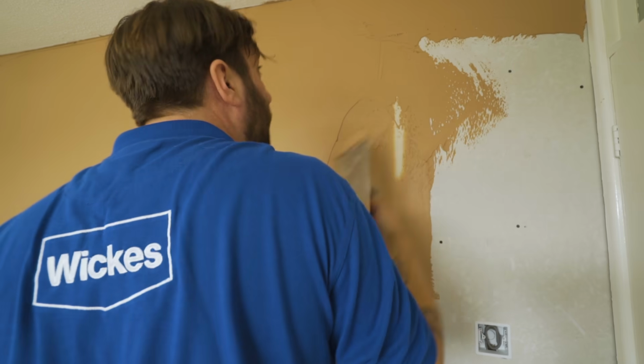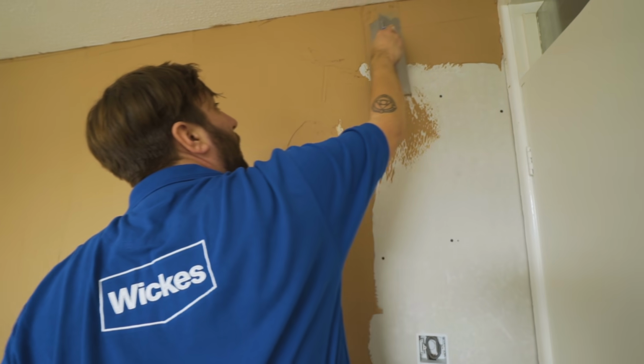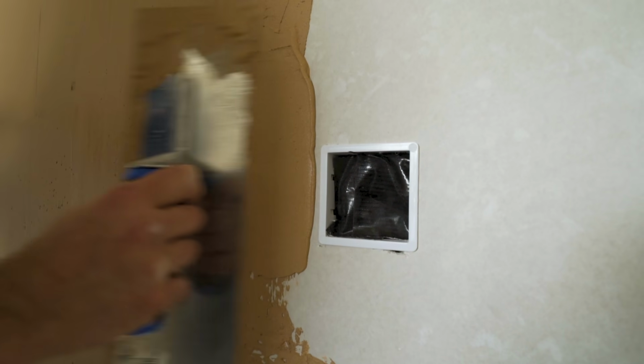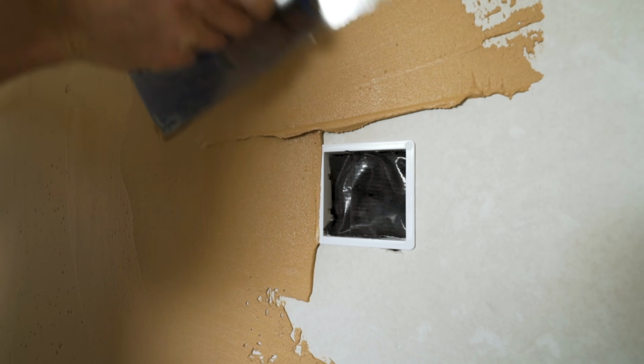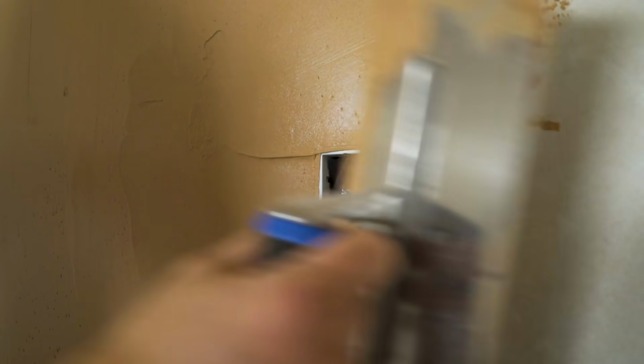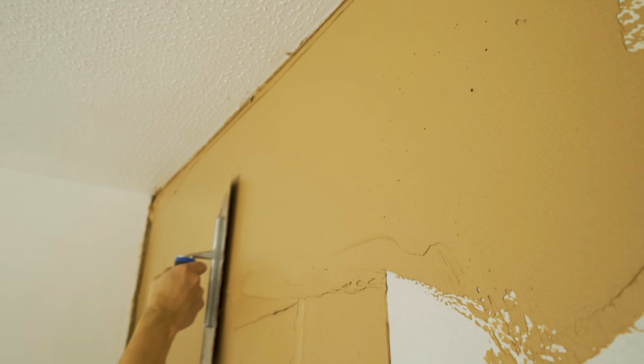left to right. It's best to press firmly and distribute the plaster as evenly as possible. Use both vertical and horizontal movements when spreading the plaster. If you need to plaster around a light socket, disconnect your electricity supply before doing so. To avoid getting plaster within, it's also best to cover the socket whilst working.